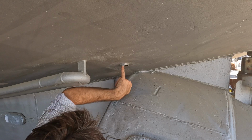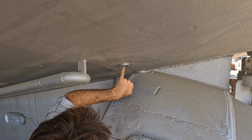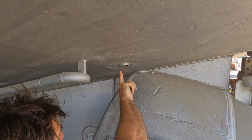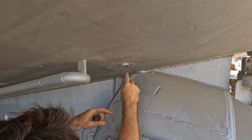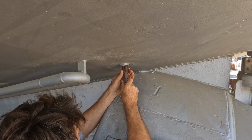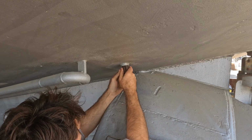There's a stain up on this side here, which to me almost looks like where the leak sort of came through, the thread sealant not being good enough. What I'm thinking is I'll absolutely nuke the thread sealant on the actual female part and then put some on the male part as well. I think maybe I just didn't put enough on and I didn't give it enough time to set, but I think maybe that was the actual cause of this.